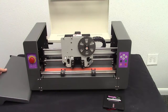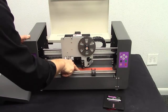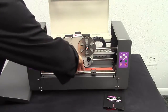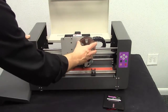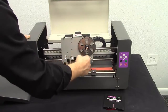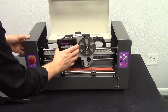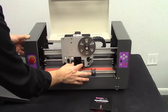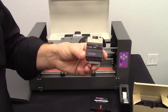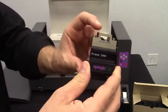I'm going to take a brief moment to describe the anatomy inside the machine, and then turn it over to Shawn to show you how to set up for your first run. You'll see these bright orange rollers — they sit on top of rollers inside the machine, and when you put in the transfer tape these lift up, which is what moves the transfer tape backwards and forwards. This is the waste reel, where all the post-punched Spangle Elite tape goes. This is where your Spangle Elite tape cartridge sits, and this is where you put your punch units.